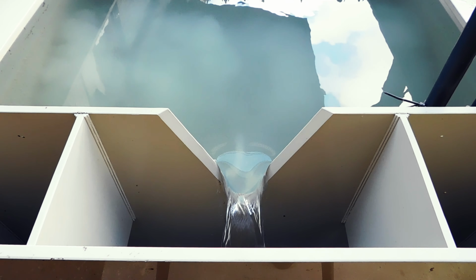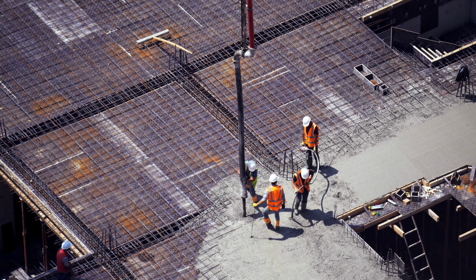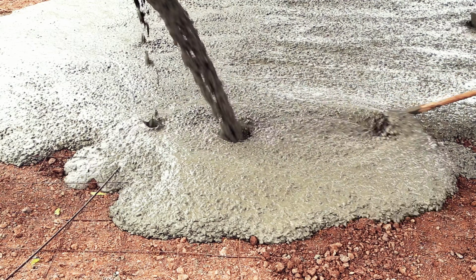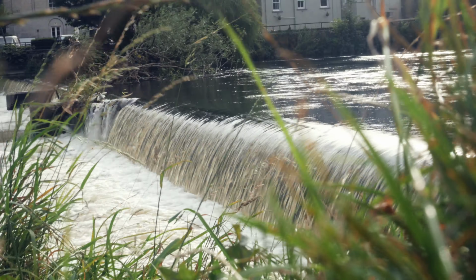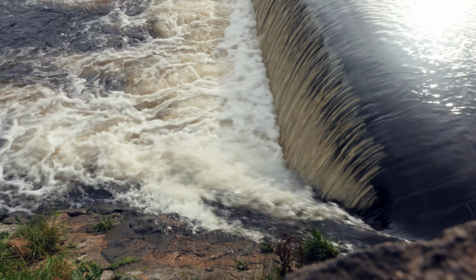Concrete washout from construction sites is a highly alkaline effluent that can have a serious impact on the environment and cannot be legally discharged to the sewer or watercourse without treatment. Failure to neutralise concrete washout before discharge from site leads to company fines and payments for environmental remediation.